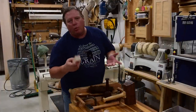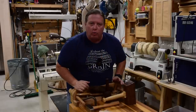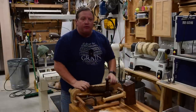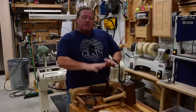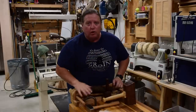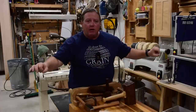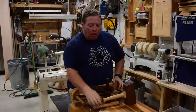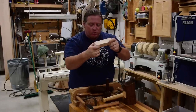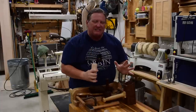The first priority of most wood turners is creating their wood blank. If you're a bowl turner, maybe you have a log that you're going to split a certain way and cut a certain size — the blank is what we put on the lathe to turn. But that's totally different from what I'm doing here, which is spindle turning. It might be a small top, but the techniques are the same I would use for making a chair leg or a baseball bat — anything long where the grain runs up and down the tree and I'm turning it on its side.